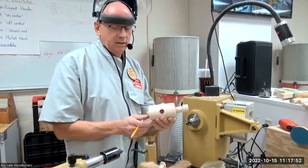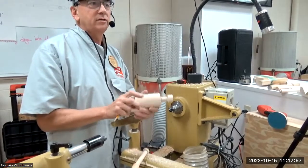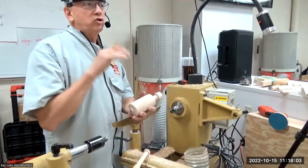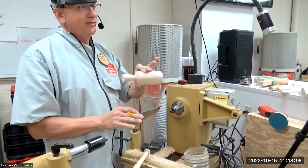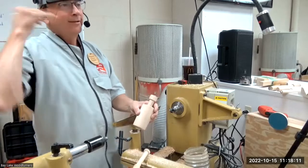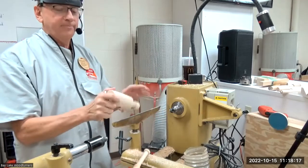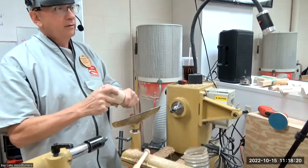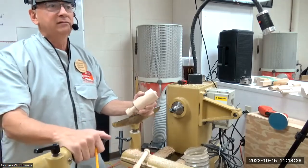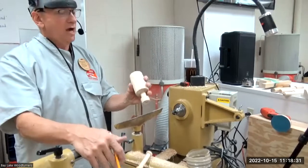So this is where I was when I started to put resin on here. I was going to do the cactus juice and then bake it. When I tried to dry this out, I got checking on both ends and some light cracks. So I called up Ed and asked, what did I do wrong? I went to another couple pieces and wrapped tin foil on the ends, about 1/2 inch on both ends. Then I cooked them an hour at a time, three times over the course of one day, and got them nice and dry. I think that would have worked out good.